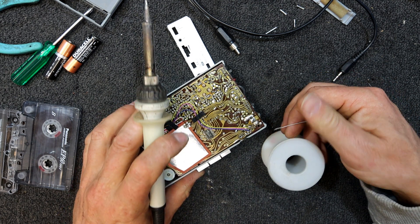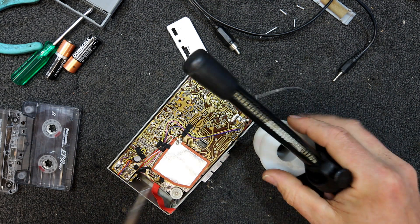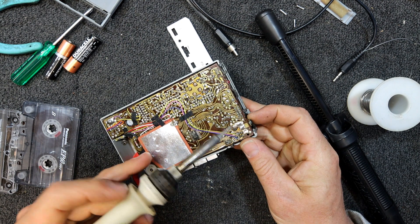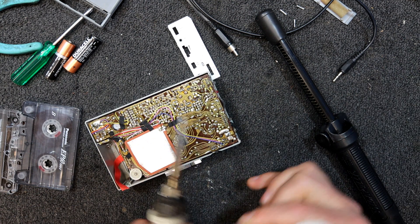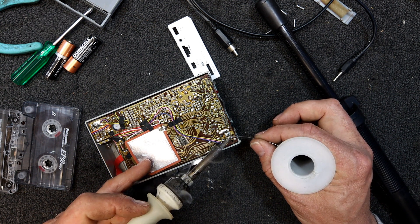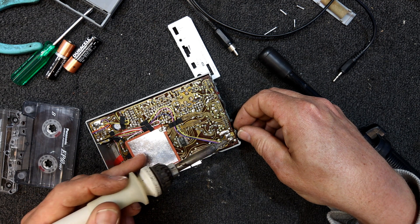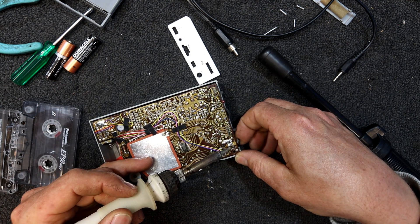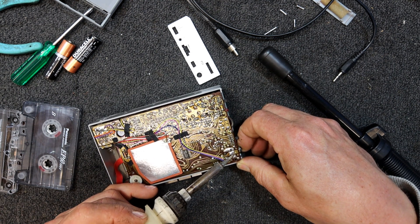What's going on there? If there is meant to be something there, it doesn't feel like there actually is something there. That could be a sign that something's broken. You should always try and feel the pin sticking through the board — there it is. For some reason I couldn't feel it. I've had them break off on the other side of the board. That's another reason you feel them — if they move too much, just make sure they're through the solder. It's not soldering the best on that side — that could be iffy.